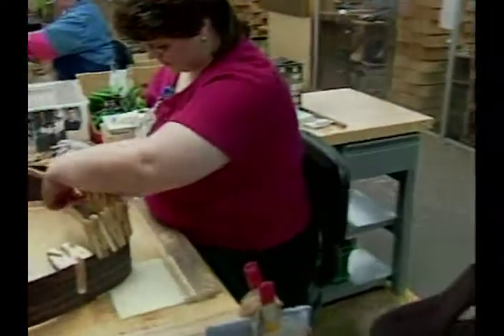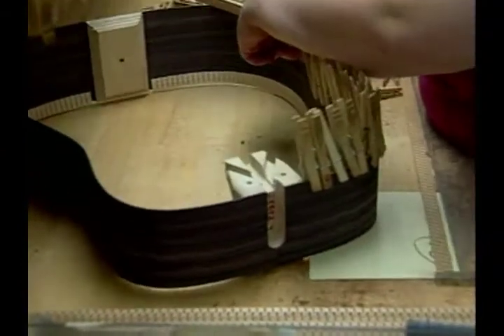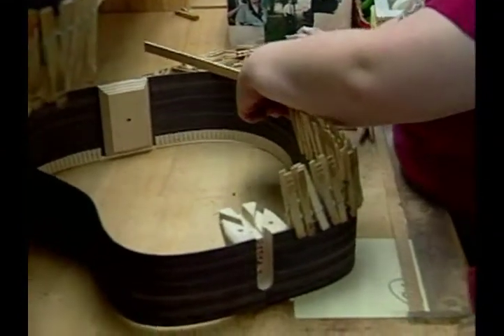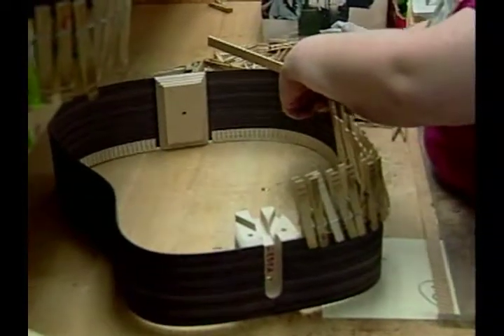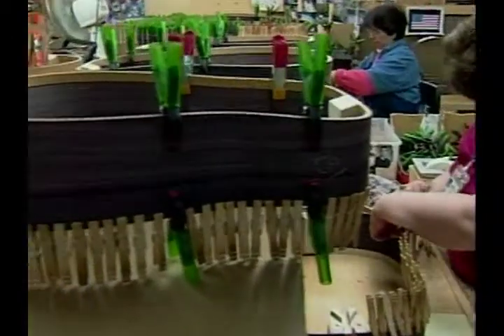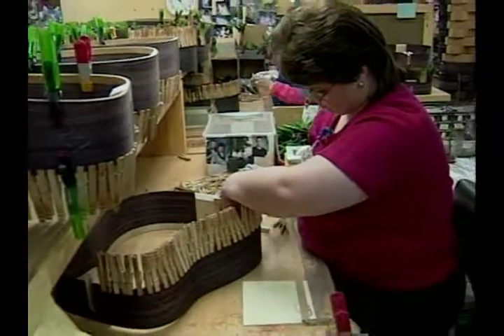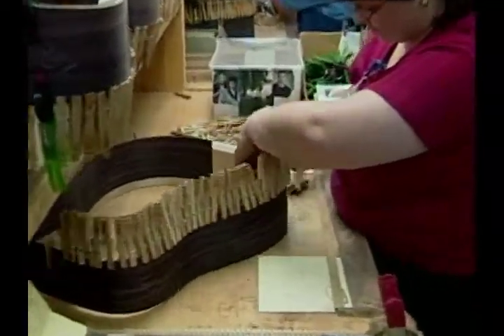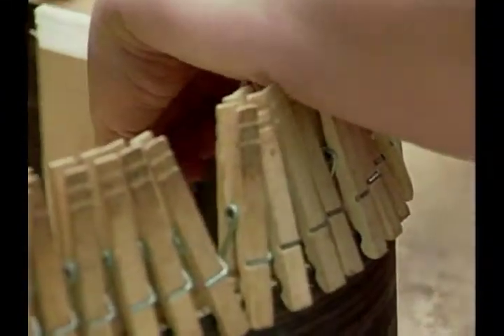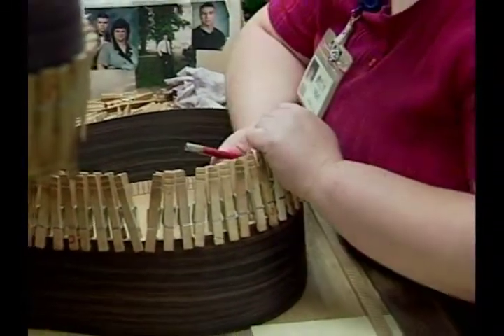What this lady is doing here, basically, is the rims after they've been bent into shape — the front and the rear blocks are glued in, and we'll be gluing in the ribbon lining, which will create a surface for the top and the back to be glued to the rim. This is done by using wood glue and clothespins, an age-old tool that has been continuing to work for us. The clothespins stay on approximately 25 to 30 minutes. There's no heat — it's just normal glue.